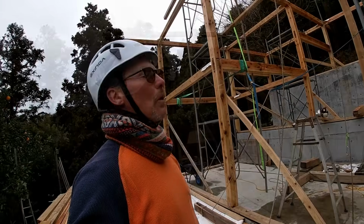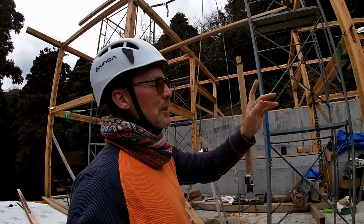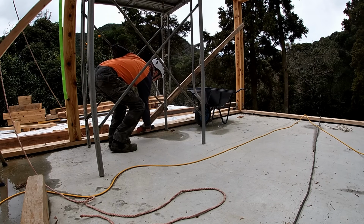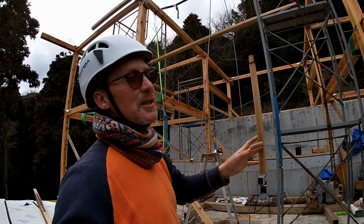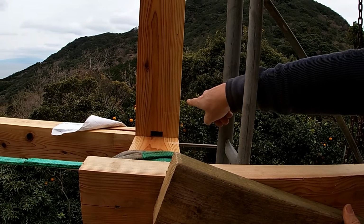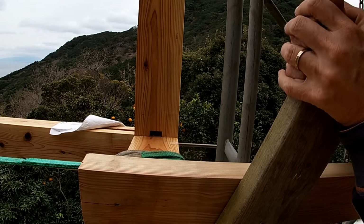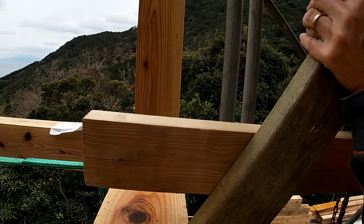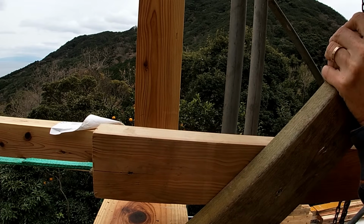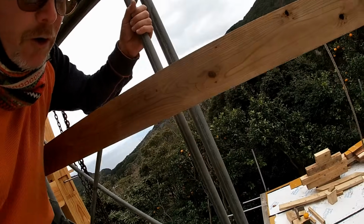Yeah, okay. What I'm gonna do, before I get the heavy ass girt up there again and muck around with it, I'm going to detach the 2 diagonals on the outside bents and go up there with the lever in here and see if I can see any flexibility. And if I see some flexibility, that'll give me heart, and I think I can go for it. As I try to spread this, let me see if I can eyeball anything right now. Oh yeah, that's moving. Definitely. Okay, I've got confidence. Now I just got to figure out how to lift up this heavy mofo.